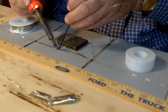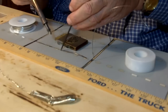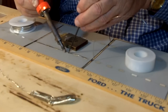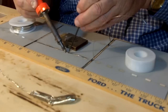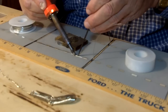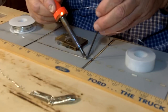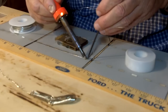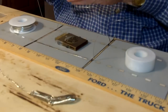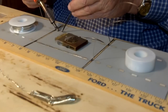There are six tabs on the back side of these solar panels that I've cleaned before. I put some rosin on there and then you just have to hold the solder and iron on there until it turns liquid and sticks right on. One thing about the 40 watt soldering iron — it gives you enough heat. If you have a 25 watt you can't get enough heat out of it; it works better with a 40 watt.